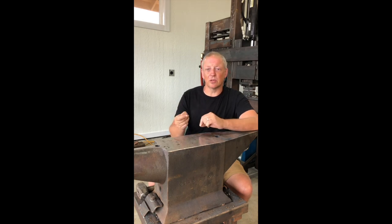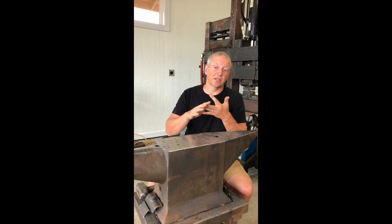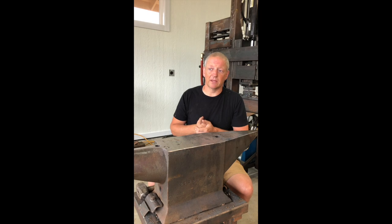Because if those don't close up, there's a greater chance of getting graphite precipitating in them, which is bad for performance and bad for your pattern. It will also deaden the ring of the steel, though that's not really a performance thing. Graphite showed up in a lot of historical blades, but it's good to avoid if you can.